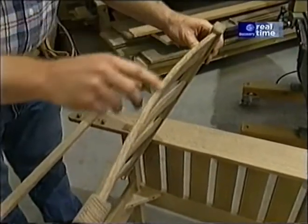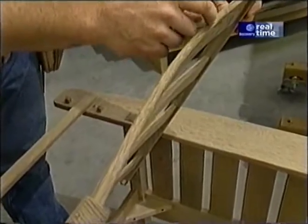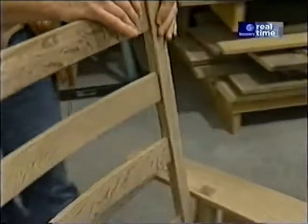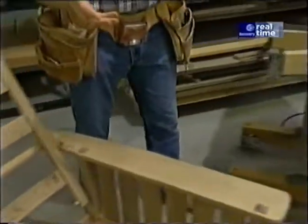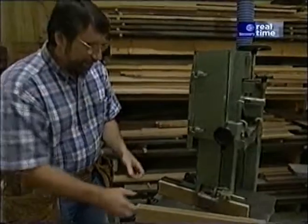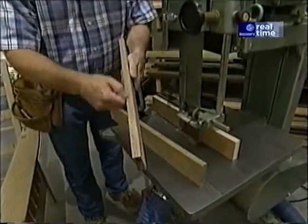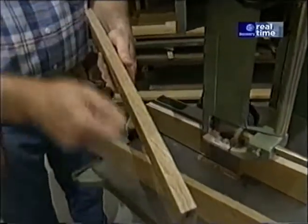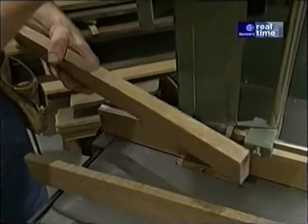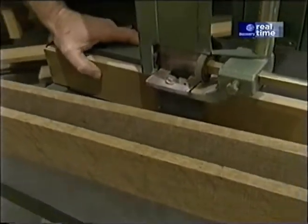This is not a single piece of wood — it's actually a lamination of two thin pieces. I suppose you could cut these slats out of a solid piece of wood, but that would be very wasteful and it wouldn't be a very stable piece. A better way is to take a piece of wood, split it down the middle, and glue it up on a curved form. The best way to split the wood is to use this re-saw, but before I use any power tools, let's take a moment to talk about shop safety.